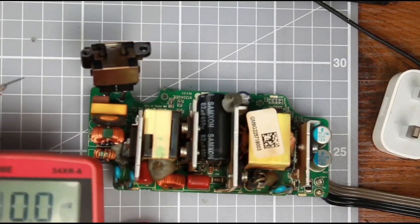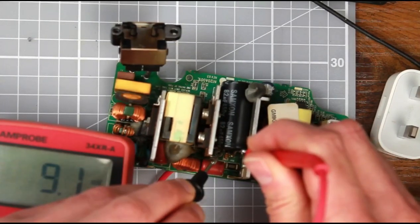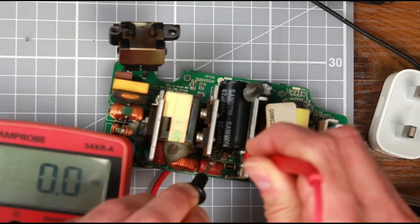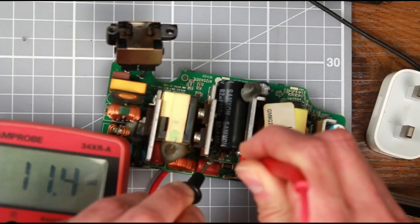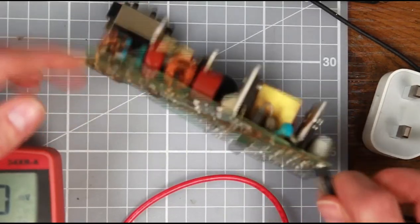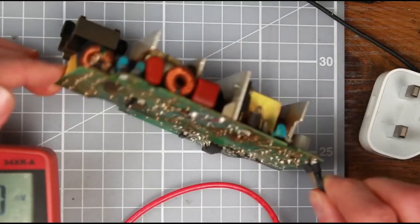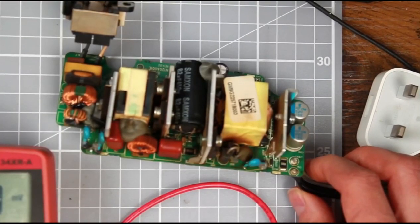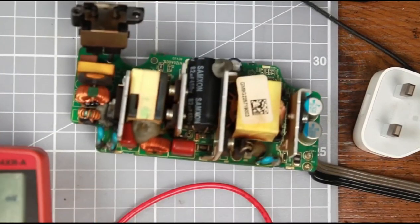If I just put this on DC mode - this has been unplugged for a little while and wasn't connected for long, so the capacitor has already been discharged and we know this is quite safe. It is a little bit of a dirty power supply but everything appears to be okay. I'm going to desolder the main capacitor, test the readings, and see what we get because I think that is the main problem.